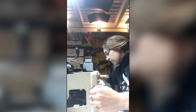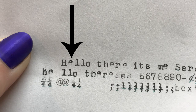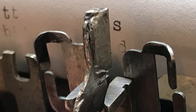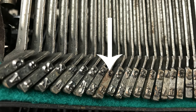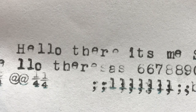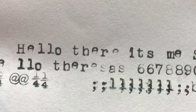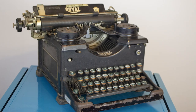Some issues still couldn't be fixed, however. I found that while type testing, the E key was seriously out of alignment with the rest of the letters when typing. After closer inspection, we realized that the type with the E type slug was broken at one point and then re-soldered on by someone who put too much length on it. I couldn't fix that adjustment, so my E's just type higher than everything else. It's definitely an interesting quirk that shows the work of somebody else that was here before me, just like those wacky green key tops.